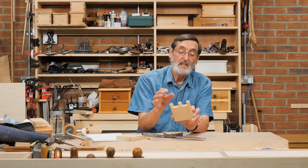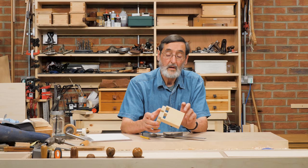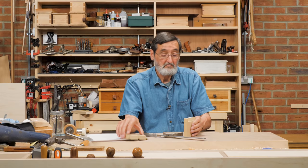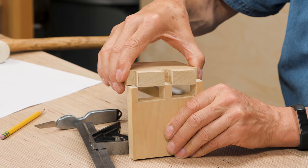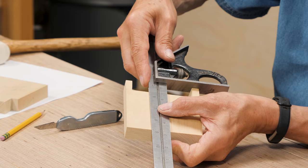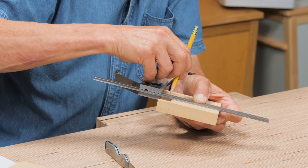If I eyeball this from back to back I can see that this has caused a twist. When you put the dovetail together you'll find you've got a gap on one side and a gap on the inside on the opposite dovetail recess — that's where that problem is caused. It's very important to get those knife walls around there and cut precisely to the knife walls. Now these gaps at the bottom part of the tail recess — watch this — if I go across here, registered fully against the ends of the pins, and take a pencil line in here...